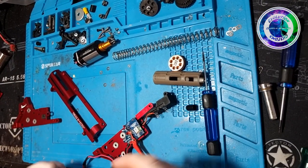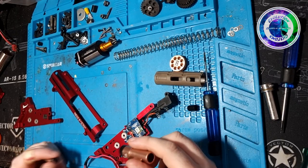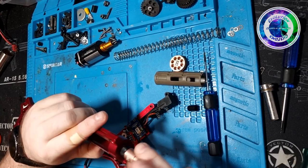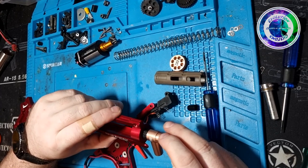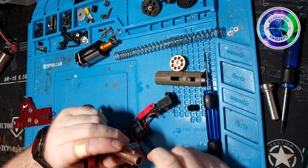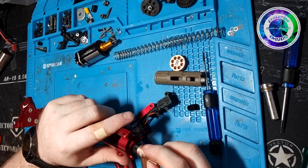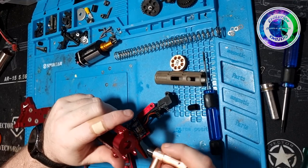The gearbox sits in a receiver with all the pins through it, the t-piece goes up, the outer barrel holds it. The way it sits against the gearbox — some gearboxes have wider and narrower front sections. On our t-piece there's very minimal slack so it's held almost directly center. On Retro Arms, I actually take one of the o-rings we supply with the Apache and put it around the actual ridge there, tack it down with one drop of glue either side, and once it goes in it stabilizes its up-down-left-right movement a lot better. On most cast gearboxes there's a lot of slack up and down on these t-pieces, same with V2 t-pieces.